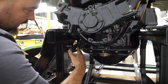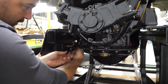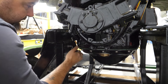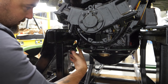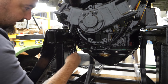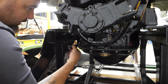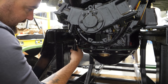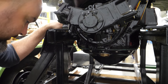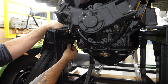One of the drill bits that I used for this was actually, you've got to drill for a quarter 28 thread, which is what we're putting in here. You've got to drill a number 3 drill hole before tapping, and I had a number 5 threaded stubby drill bit, but not a 3, so I used a universal chuck, and I took a drill bit, cut it down, turned down the shank of it, and stuck it in there, and it gave me basically a 1-inch long drill bit that fit in here, and allowed me to get the correct diameter of hole to tap.